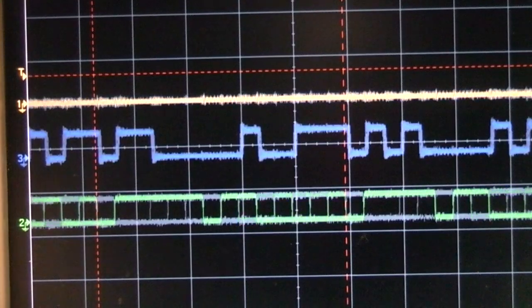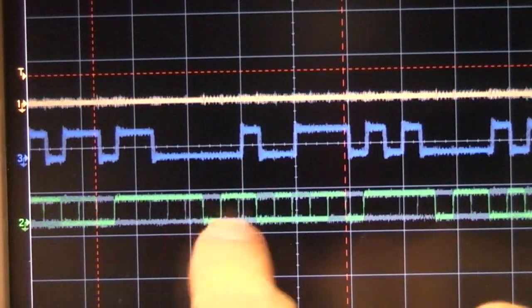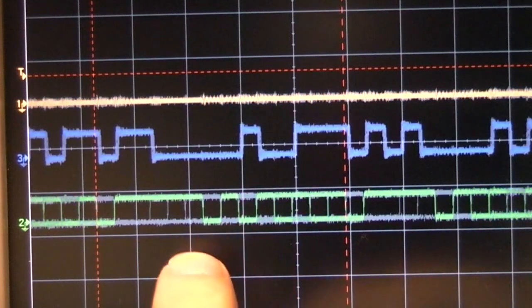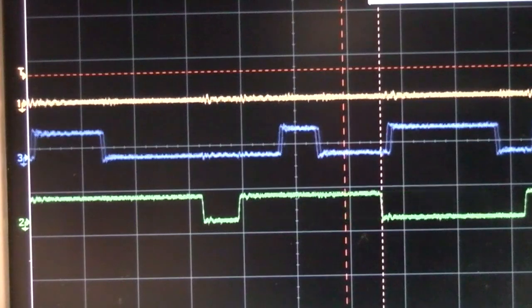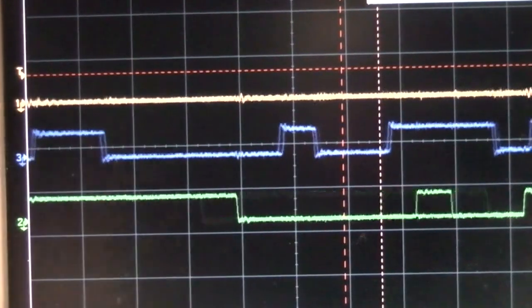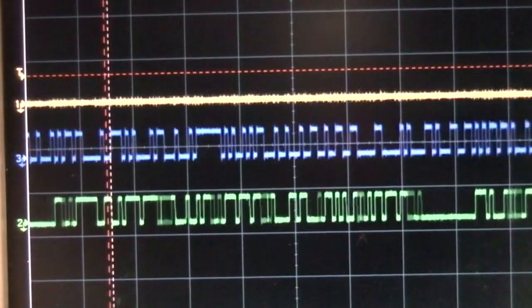Yeah, it looks like we've got 14 bits of data. I haven't found any obvious clock for this. It could be using the 60 MHz clock, or there might be another signal buried on it in a layer or something. So look at the data rate. This is about 15 MHz, so that's a quarter of the 60 MHz incoming clock.